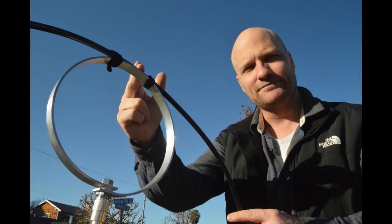Now, the key to getting the signal to be inductively coupled to the loop is this 5-to-1 smaller loop, sometimes called the primary, very similar to the primary of a transformer. And the primary concentrates the magnetic flux lines which cut the small untuned feed loop, and that equals higher Q, especially on 7 megahertz, but a slightly lower Q as we go higher in frequency, but the efficiency actually is greater. So the impedance of the main loop is independent of frequency, and this little feeder loop run right in line with the main loop is what it takes.